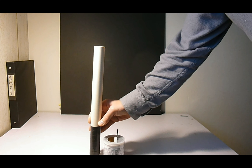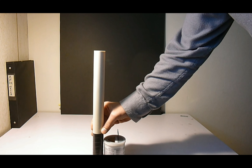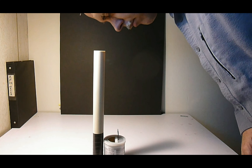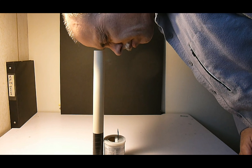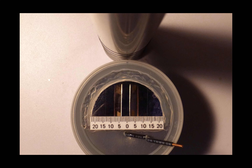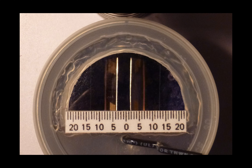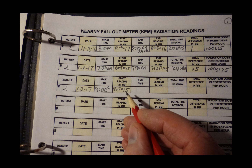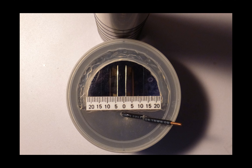Place the charging pipe in a vertical position up against the backside of the KFM. Rest your forehead against the top of the pipe and hold your head very still with one eye open. See where the bottom edge of the leaf lines up with the millimeter scale. In this picture, the left leaf is at 8 millimeters and the right leaf is at 7 millimeters — write down the sum of both readings, which is 15 millimeters.